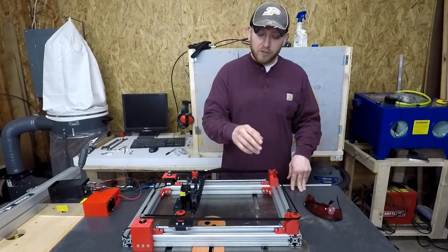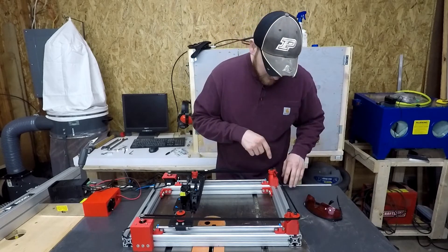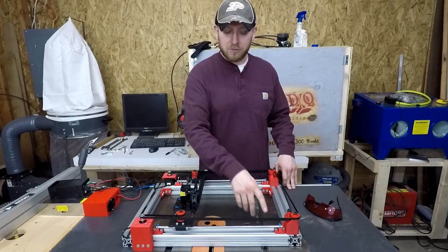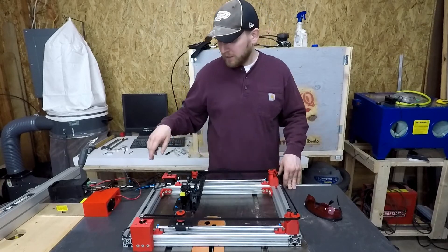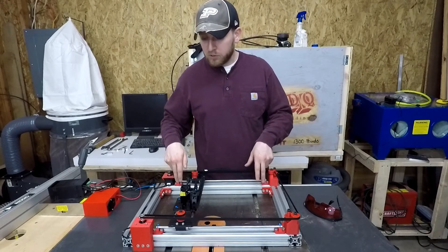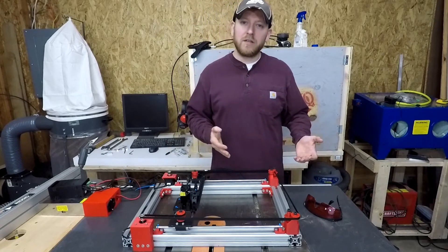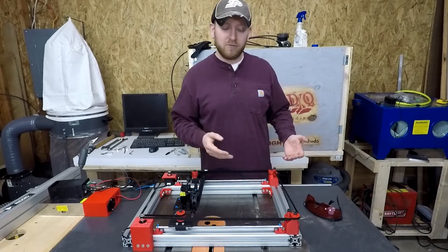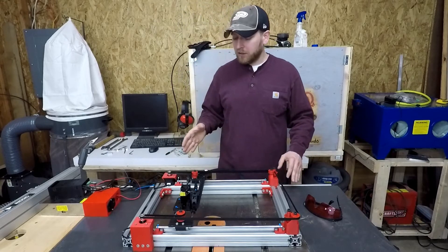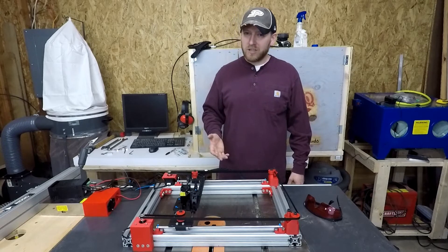This was very sturdy — I was really surprised at that. Another thing I would have changed: there are counterbore holes down in here. I made those fit for M6 by 16 millimeter because that's what I used for the corner brackets and rod supports everywhere. I should have just made it M6 by 25 or 35, but live and learn. I did it pretty quick — about three modeling sessions to get this done. All in all, it turned out pretty decent.